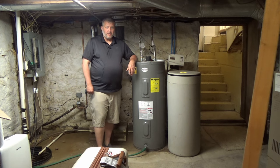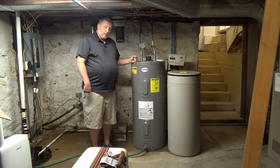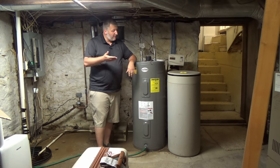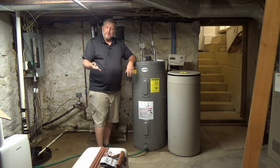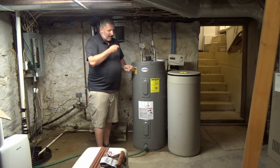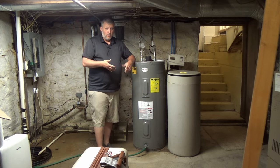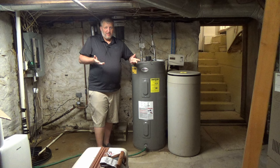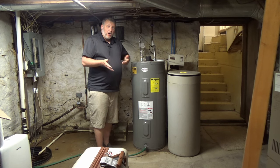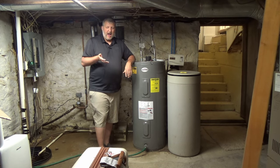What's going on guys, it's Eric again back with another video. We're back downstairs with the Richmond water heater. I've seen quite a bit of comments on part one and part two — taking the magnesium anode rod out and putting the electric anode rod in — asking: does it work? The final conclusion is, kind of a spoiler alert, I don't know. The only real evidence I have is there's no more sulfur smell in the water anymore.